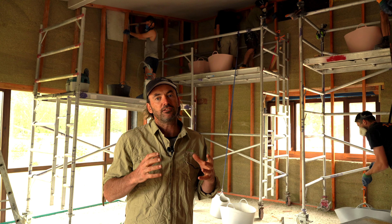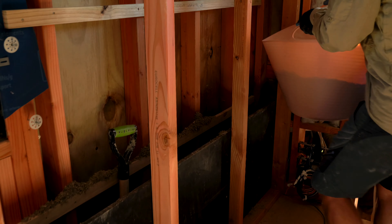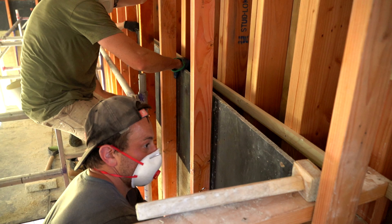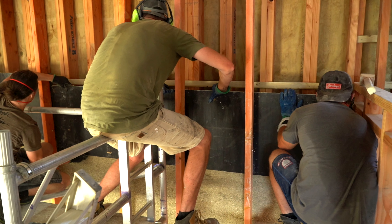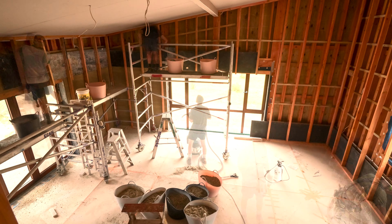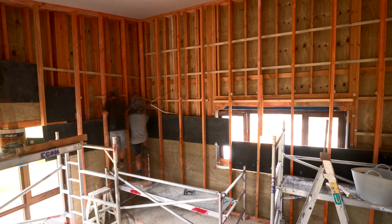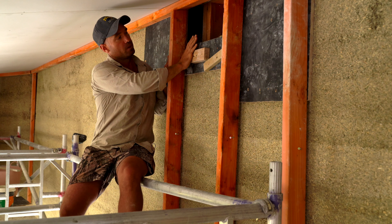In behind the part that we're not seeing, we're tamping it enough to stick together but we're trying to keep it a little bit loose to maximize the insulation of the hempcrete. This wall behind me that you can see has temporary framing which is part of our formwork — we pull about 600 millimetres at a time and we just slide that form up as we go. Shuttering is there to keep the hemp in place between the outside wall and the inside wall.